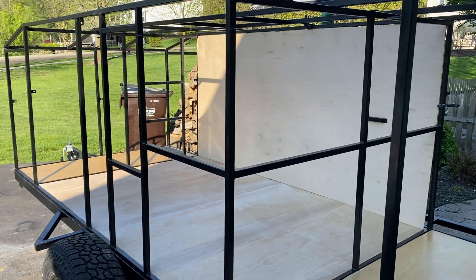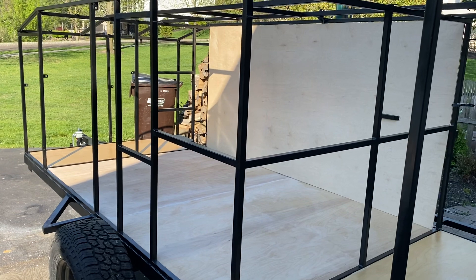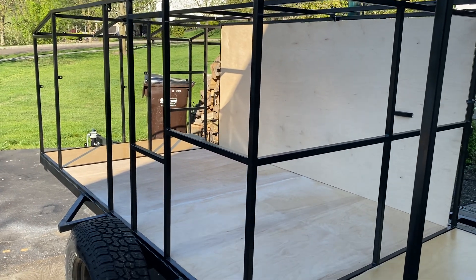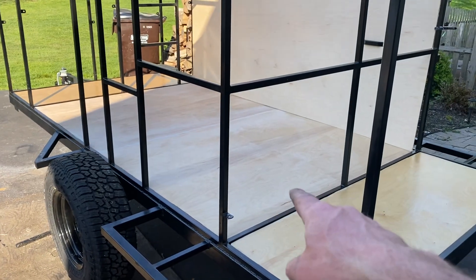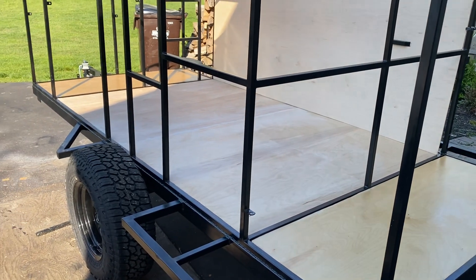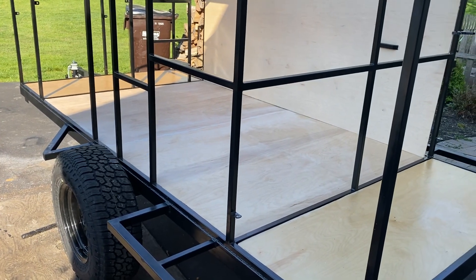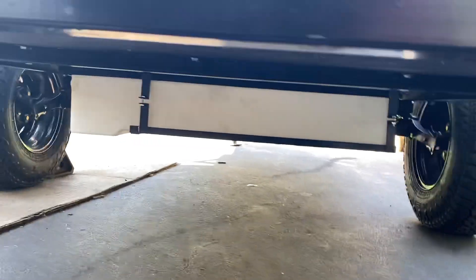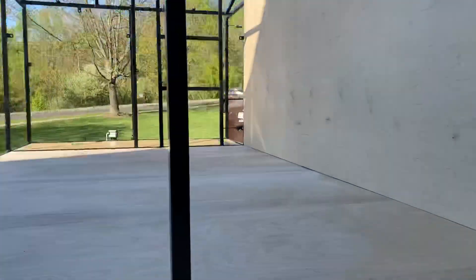I got pretty much everything I wanted to do this weekend done. I put the top floors in — and I forgot to mention: under the top of the floor there's one inch insulation, and on the bottom I used eighth-inch plywood and painted it with black fence post paint, which came out pretty good. I'm going to put one more coat of silicone underneath around all the seams. I siliconed on the top already but want to do another coat from the inside and on the bottom so it comes through, then I'll put another coat of paint on the frame. Please hit like and subscribe — any comments, suggestions, or anything you see that you don't like, post them so I can potentially fix it. Thanks a lot for watching!